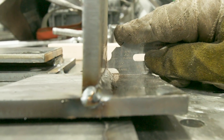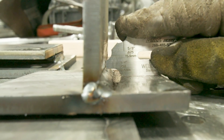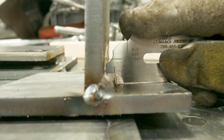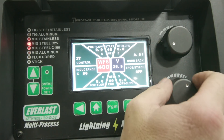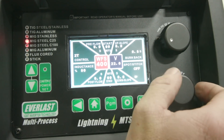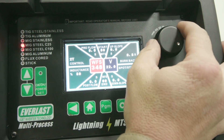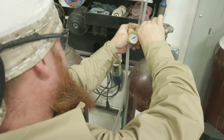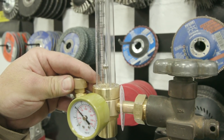We're going to check and see that we have a quarter-inch weld — and we do. Let's go ahead and do the short circuit weld. We're going to operate on the higher end of short circuit to give it the benefit of the doubt: about 22 volts, about 325 inches per minute on the wire feed speed, switched over to 75/25 gas, and run about 15 CFH.